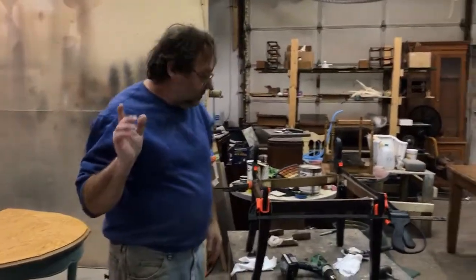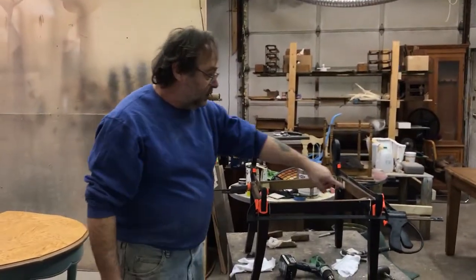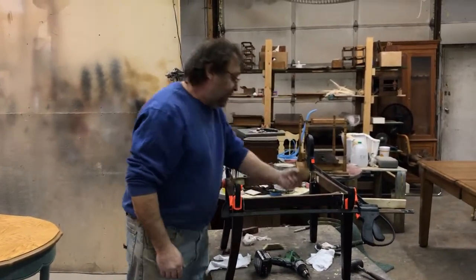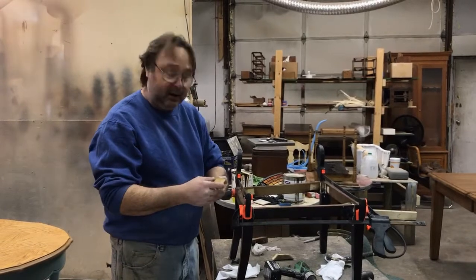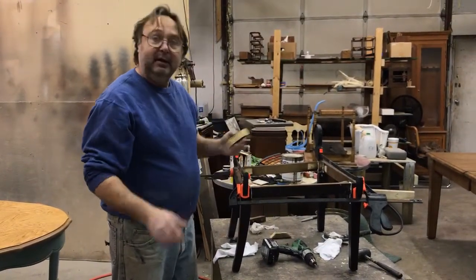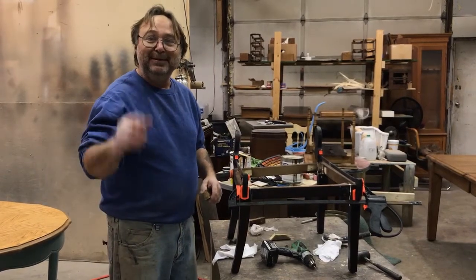We're not going to show a whole lot more. I'm just going to wipe this glue up, and my next step is my corner block. So I took it out. I'm going to clip that pin off, clean this up a little bit, put some glue here and put it back, and this chair should be in good shape for quite a while.